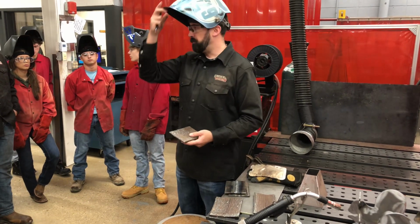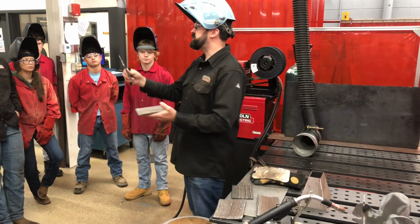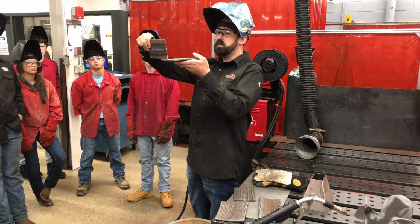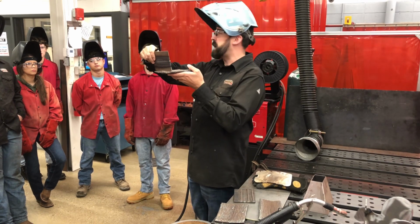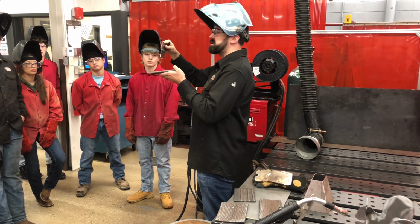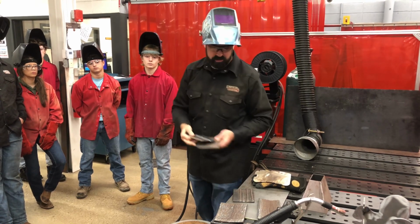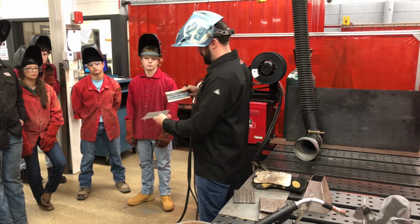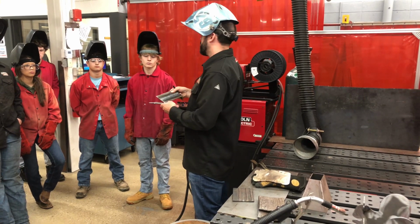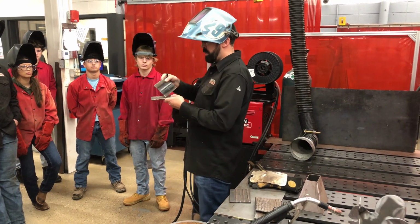Here's how I grade them. I take a piece of straight steel, a ruler, something like that, and I put it on top. There should be no valleys between the tops of your mountains. So from peak to peak, no valley. That's the goal. For example, this guy had a couple, and this is not quite perfect. You can almost hear it, it's like an accordion. You went back and filled them in.